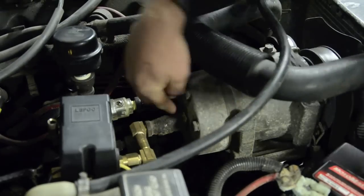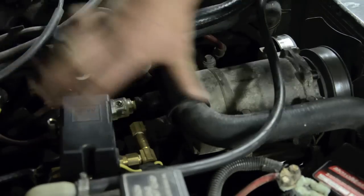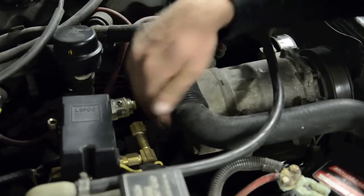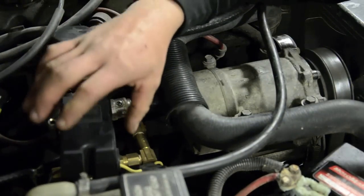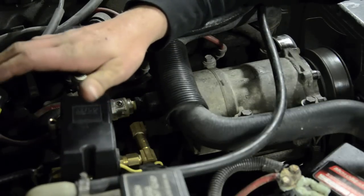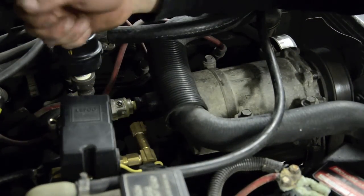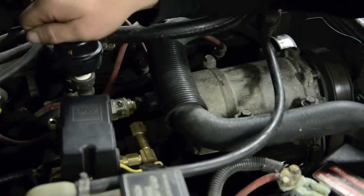Now on the other side, on the outside, I had it come out. I put in a couple of elbows just to get this stuff out of the way from the distributor — it would have been a nightmare to do any work on the distributor afterwards if I didn't route it somewhere else. Now this here is the regulator switch. The way it's wired in is pretty simple. In the fuse panel, just hook up to whatever says auxiliary or ignition or IGN or something like that. You can just put it right in there.